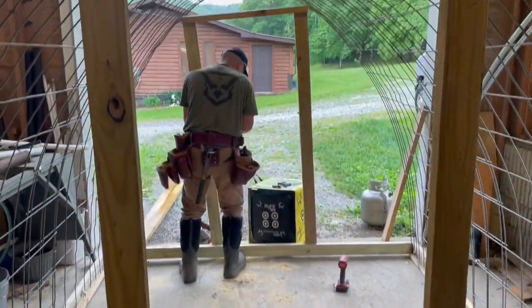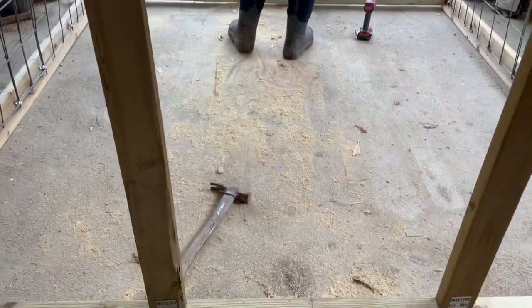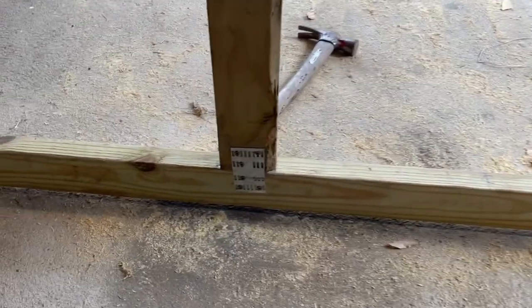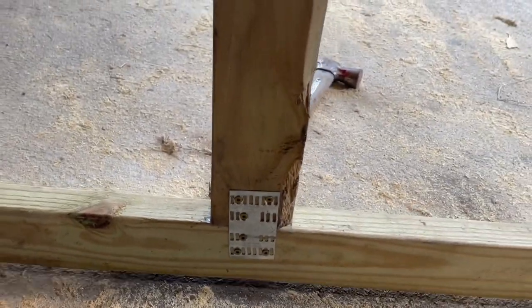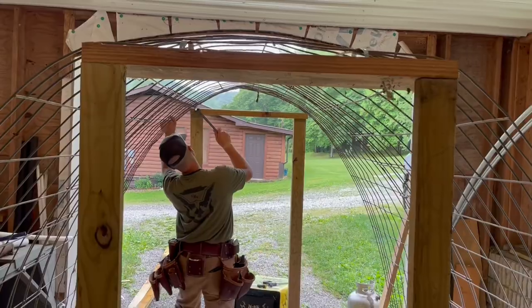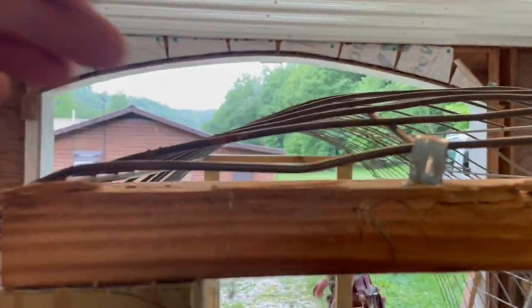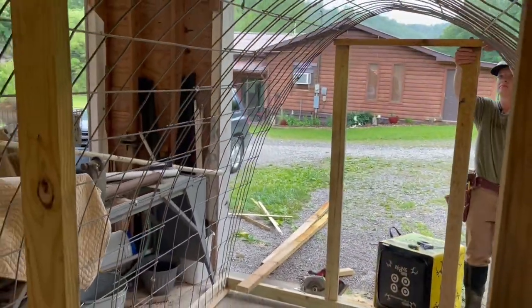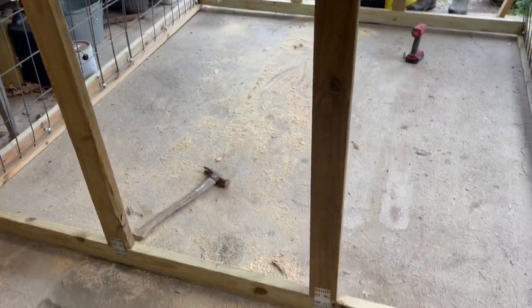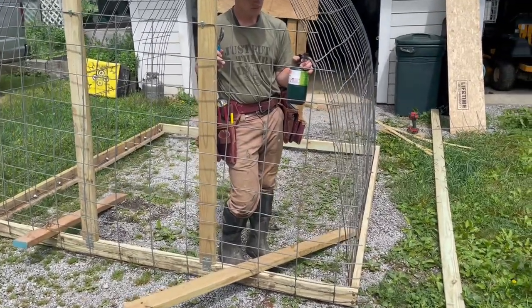To get your wall members, we are putting this inside — this will be the door and the other side will be the nesting box. On the door I use truss gussets with a few reinforcement screws to fasten the bottom of both uprights. They're 67 inches tall, and then just a flat member up here screwed down from the top to fasten them in. The wire is connected to this header with a conduit clamp, and that'll serve as the frame for the door.